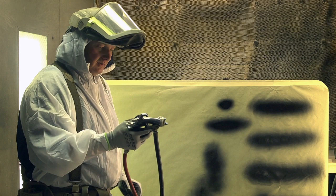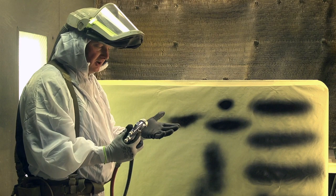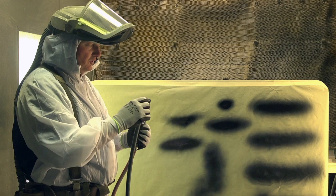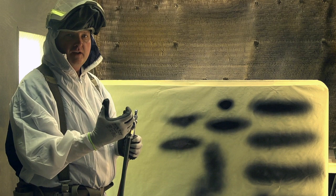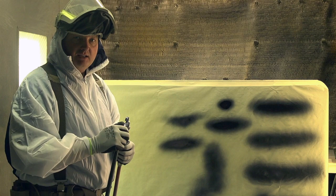This is your fluid fan pattern. We always check fluid at full trigger, just set it at the pot. If there's an issue with your pattern that doesn't look right, loosen up your retaining ring, spin your air cap 180 degrees and try it again. If that fixes the problem, there was something obstructing the airway. If it doesn't fix the problem and the issue follows the air cap, take the air cap off, try cleaning it, put it back on, and check it again. If it's fixed, it was obviously dirty. If it doesn't fix it, the air cap is probably damaged — get a different air cap. If it still doesn't fix it, your needle and nozzle is either worn out or damaged, and that's when you need to rebuild the gun.